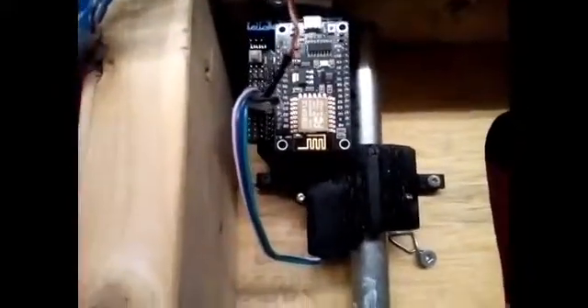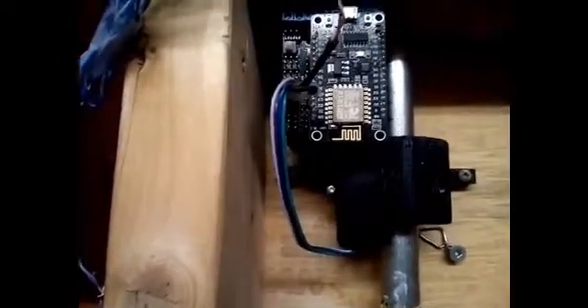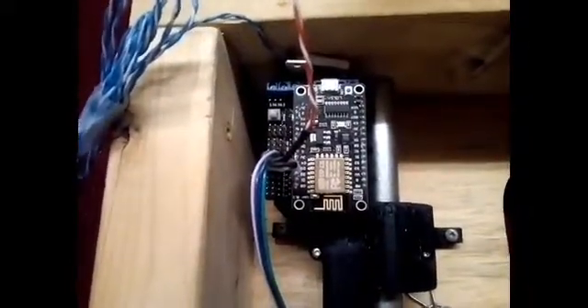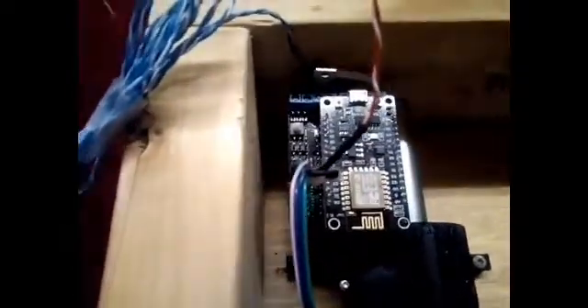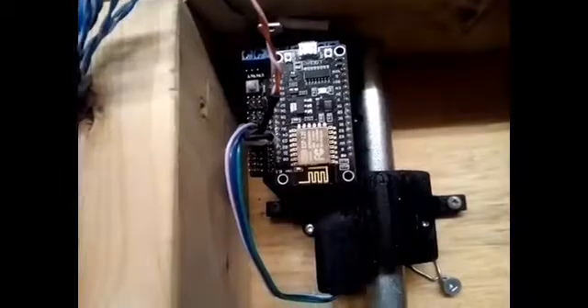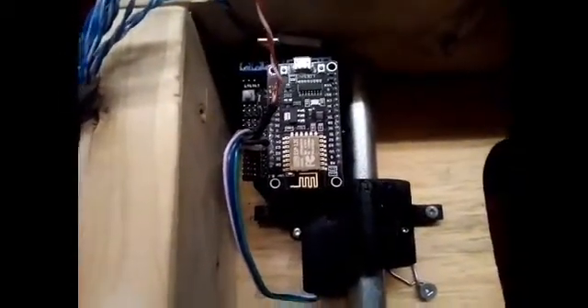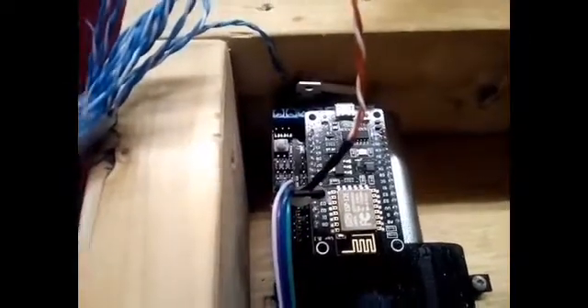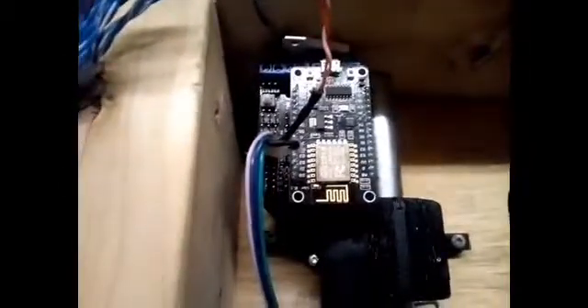This servo winch is running on a NodeMCU board and a little 12-volt H-bridge driver. We're only controlling one motor. That TO220 package you see back there is a 7805, because the little onboard voltage regulator on the NodeMCU board isn't up to dropping from 12 volts down to 3.3. So I've wired in an LM7805 voltage regulator — it has no capacitors on it, but there are some on the board that stabilize it. 12 volts go in, and the NodeMCU board talks to my laptop, which I'm going to show you.